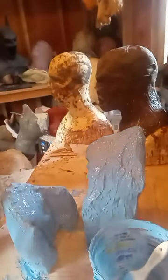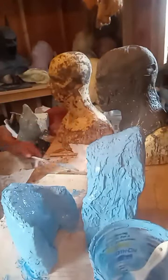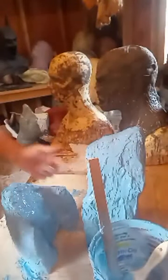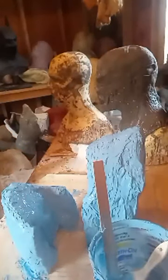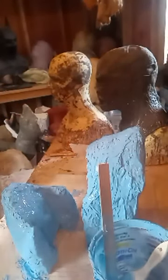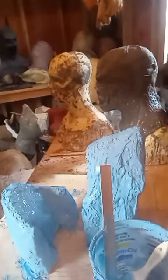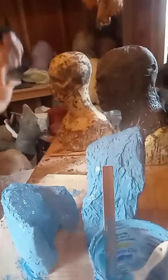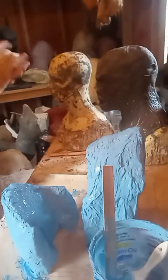And there again, you can also do things like use buckets. When I've got a piece this size, I can take a bucket, same shape, put that in a bucket, and it holds it while you're slicing around. That's what I did with the Godzilla. I have an oval-shaped bucket over there that I slosh that around, put the resin in there, and wiggle it around. And I don't have to worry about the mold slipping or pushing it or pressuring it or anything.